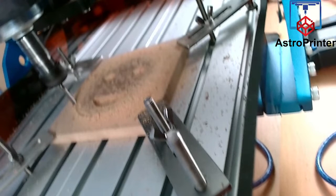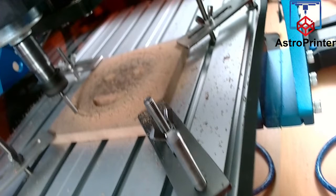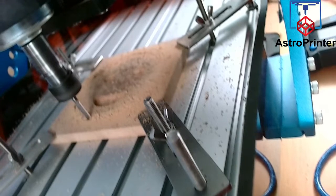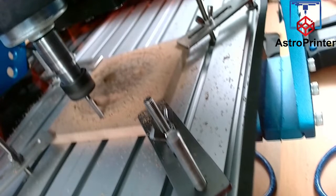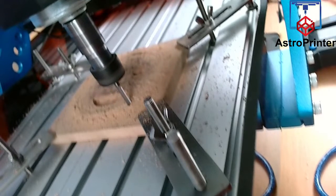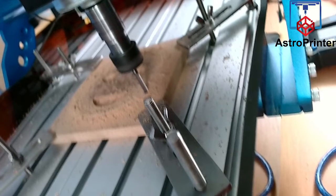For those who just joined in, the Comgrow Robo CNC is working. I found the issue was the connector. The wire should have been turned 90 degrees on a 4-pin connector. So I made a few tweaks and we're operational. You should start up a CNC.